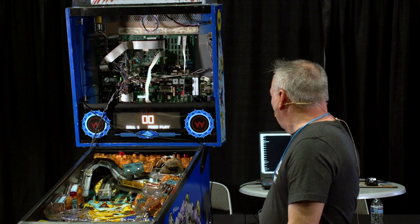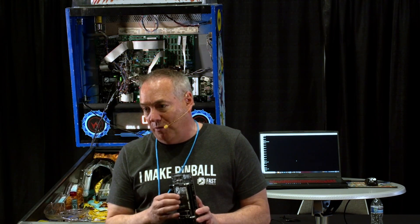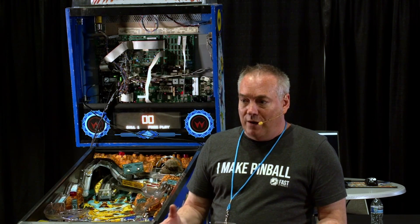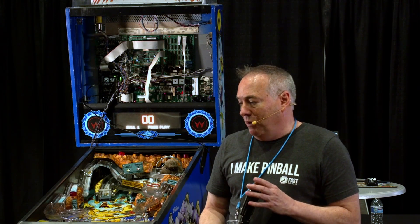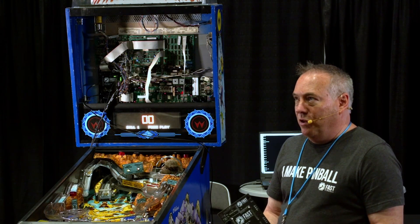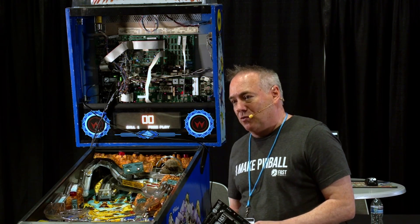The way this board works — if you were doing a high-volume game based on segmented displays like the new Pulp Fiction, you really could run that whole game from here, probably using just a microcontroller sitting on the board. If you needed something like a Raspberry Pi for HDMI content, we have boards that support a Pi — the Neuron is one of those. You could put a Raspberry Pi right on the Neuron board, have your AV content coming off that, and because you're on the controller board, you also control the machine. For something bigger, there's a USB connector, and all you're really doing is setting up rules over USB — the machine still does its own thing until you decide to change those rules.